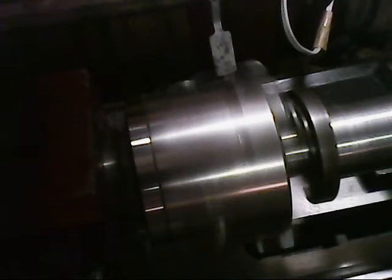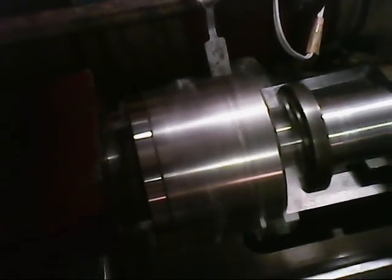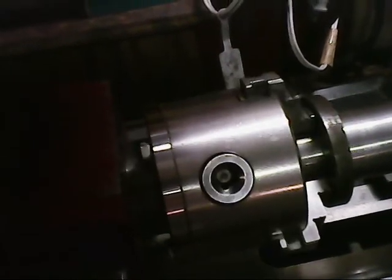I'll turn the switch on and we'll turn it on slow. Then we'll put it on nice and slow. This red light indicates that there's feedback, so I'll put a little bit of a load on the motor here and the light comes on. That's indicating that there's feedback coming back to give me some torque control.